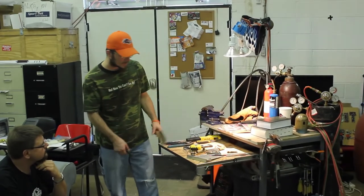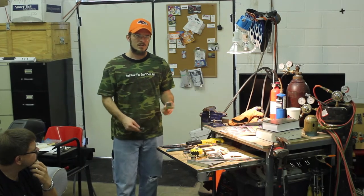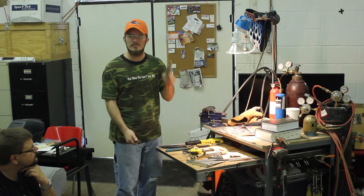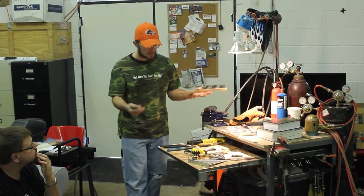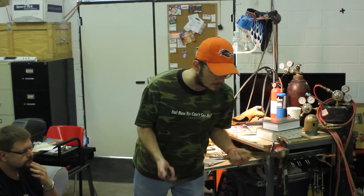After every weld, every moment that you stop and look at it, the weld oxidizes. So if in doubt, you just stop and wire brush it. Clean it off, get it nice and clean before you go again, otherwise you're going to end up with micro separations in between. Get a collection of wire brushes. I actually have a shameful lack of wire brushes right now.